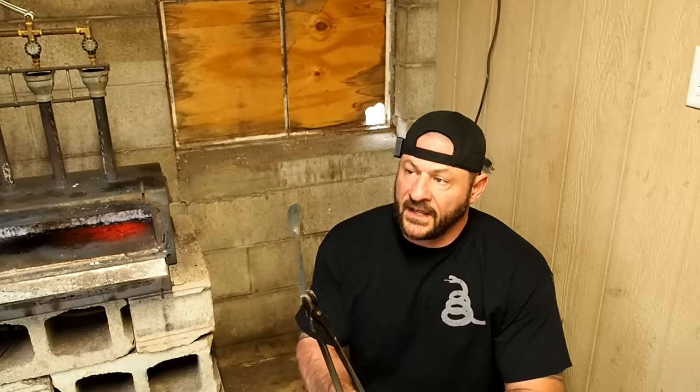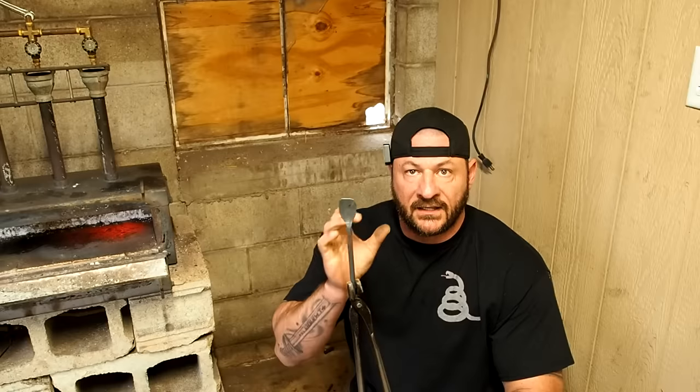So the downside of 5/16 is the more you pound it, the thinner the spoon's gonna get. And no matter how hard you try, you're only gonna get that thing so wide. Otherwise it's gonna be paper thin, and once you just push on it, it's gonna bend, and you don't want that. So something like that that resembles a rough spoon shape, you're in business.